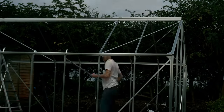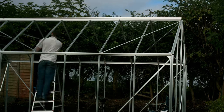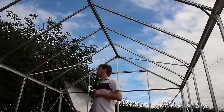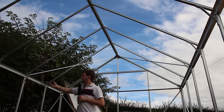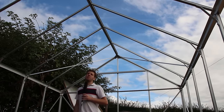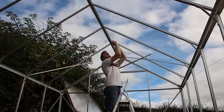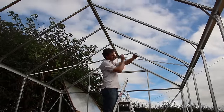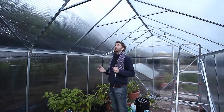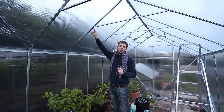Let's get started on the porch, and after that we just need to build the doors and then do the glazing. The top of the greenhouse is almost finished. I started with the corner cross braces and then did up two bolts on each of the slats all the way along both sides. I haven't done the top bolt yet because there needs to be a cross brace across the top. One thing I definitely recommend is to slide the bolts into place and count how many you need before you tighten the top and bottom, because you'll often need to slide in a couple of extra bolts.